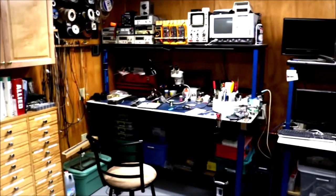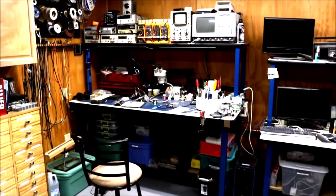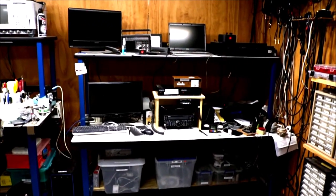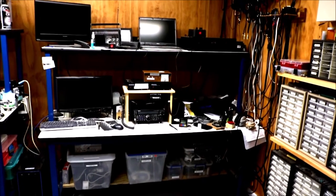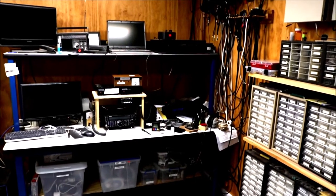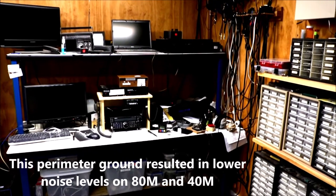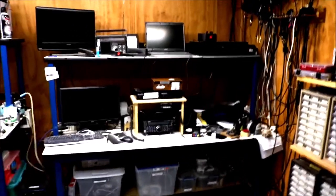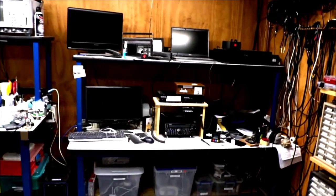Back in the lab — a couple of final points. The conductive mat on top of the lab bench is connected to the ground. On the amateur radio bench, all the radios and the computer connect to a single point on the copper tubing pipe at the back of the bench. Along the perimeter inside and outside, there are connections to the actual ground. If you have comments or questions I'll try to answer them — please hit like and subscribe.